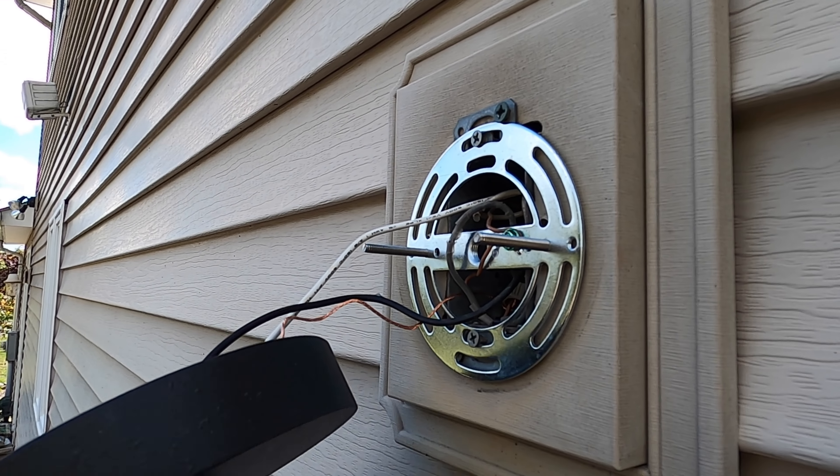We're going to get these wires back inside the box, out of the way. When I push them in, I like to keep the wire nuts pointing up — I don't like to have them upside down in case there's moisture back there. Then all we have to do is mount our fixture on there, make sure all the wires are kind of tucked inside. The wires can go anywhere inside this canopy, so if something's sticking out that's okay. I just tend to push them in so I can get the fixture lined up a little bit better.